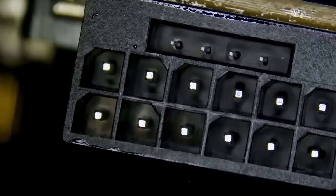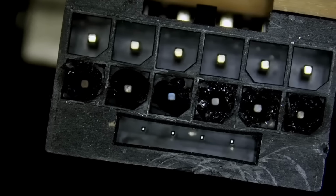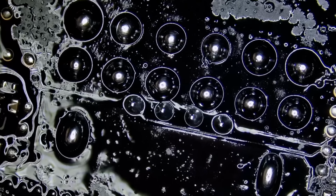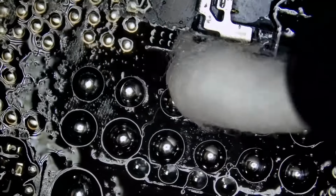You see how the four pins are all the way on top here, or on the bottom as I have the board oriented. And if you look at the one that we are working on right now, which uses the regular 12V HPWR connector, the four pins are on the bottom, on the side of the board. The four pins here are away from the board, and you have that notch right here. That's ASUS. ASUS wants to be different. So ASUS connectors burn, while Founders Edition connectors break.